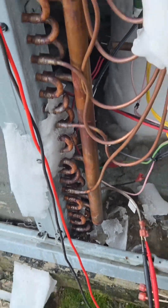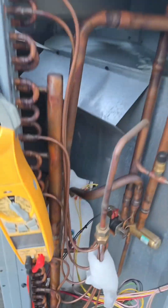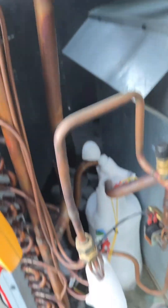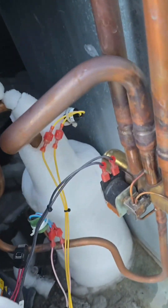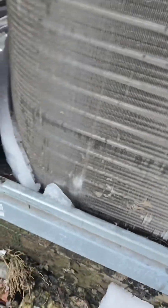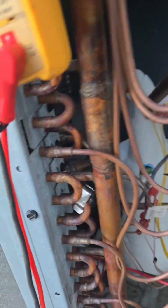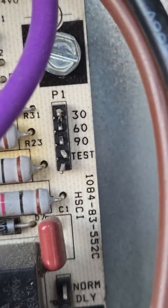So we're going to hook up the new defrost sensor — we're going to change it. The coil is almost done. I moved the sensor from down there — remember it was not frozen down there — to right here, halfway up the coil. So next time it gets to that position, it'll go into defrost. And I'm going to set the timer to every 30 minutes versus 60 minutes.